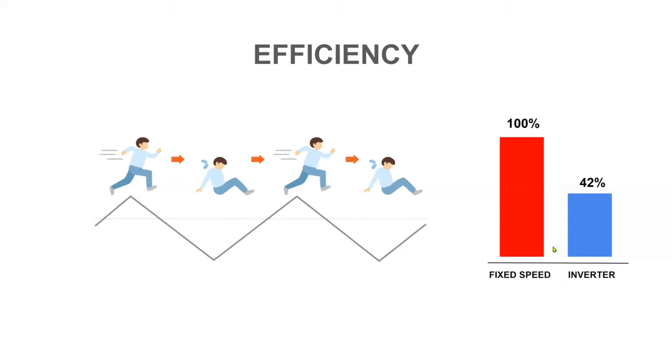So, for example, just in easy numbers, if the compressor at 9,000 BTUs used 9,000 watts of power, which it never would, and I'll say 900 is probably more accurate, 900 watts of power. So you would think at 3,000 BTUs, it'd use 300 watts of power. But that's not actually right. At 3,000 BTUs, it might only use about 100 watts of power.